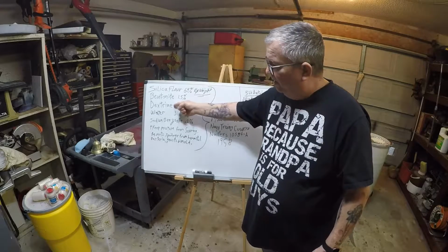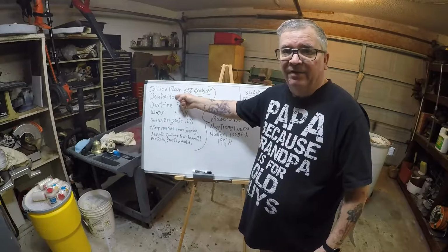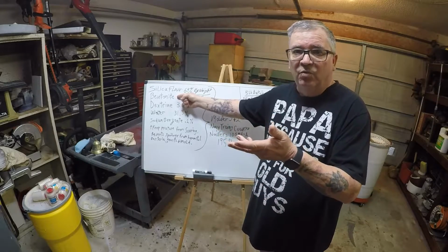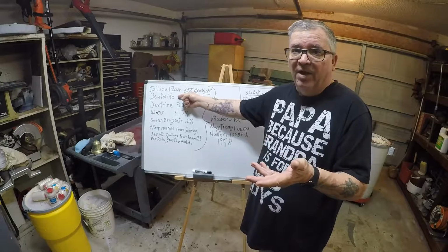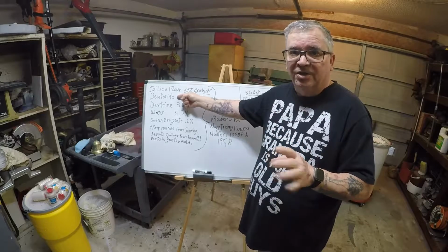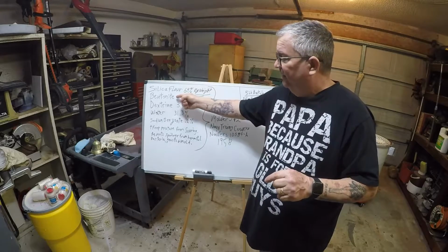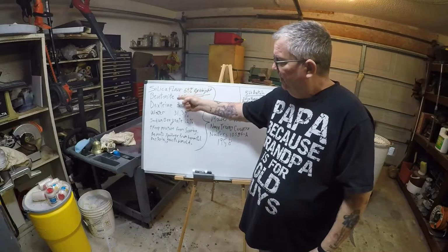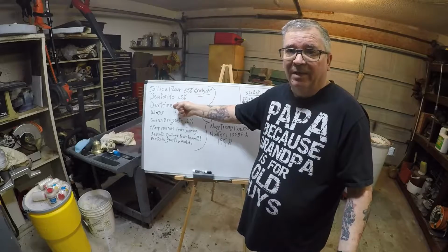but this is an organic binder, okay? The bentonite is inorganic, basically made of clay, which is a degradation of some type of stone, whether it be granite or whatever. When the granite breaks down, a lot of it turns into clay. Those of you who are geologists would know better than I would. I'm just hoofing it right now on that. I remember reading about it, but I don't remember what kind of stone it was that turned into clay. Dextrin is organic, meaning it comes from plants, okay?